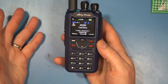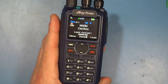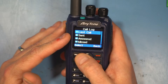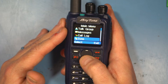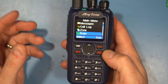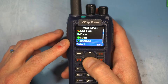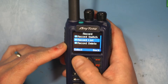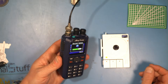As far as use case — if you're familiar with these AnyTones, the menu brings up a traditional view of a DMR radio where you select your talk group, view call logs, and navigate zones. Zones are a way to organize channels — you've got to change your mindset a little bit with DMR, where a channel is basically a repeater. There's also a record function; we turned it on and played back an example of that.